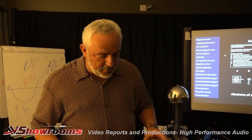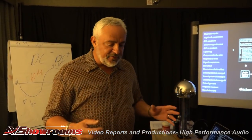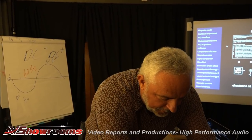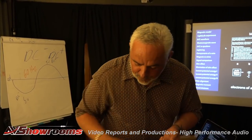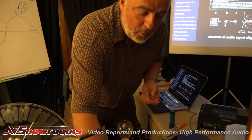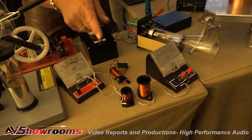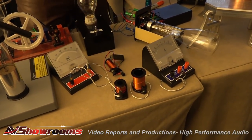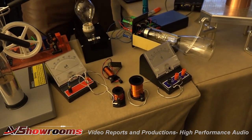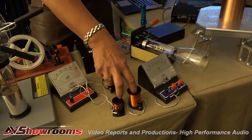So basically, we've got this concept where electricity is delivered through this process called induction. And so then, if we were to look at this farther, when the power company brings that energy in, they bring it to a winding like this. And then we have a winding on our side of the fence, and our winding is smaller, and what that does is it steps down the voltage. So that magnetic field that's in here is picked up by the second one. Now to increase the efficiency of that, Peter, what they do is they put an iron core in the middle of this.